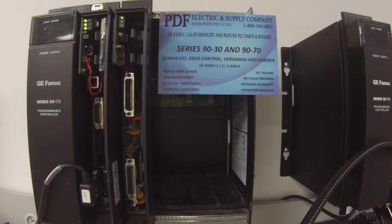I have this in run mode already, so I'm going to hit the lightning bolt icon, which is the online/offline toggle. I'm going to take myself offline, which is going to free up the serial port in the back of the computer. Then I'm going to go to File and Exit — we're going to exit Proficy Machine Edition.